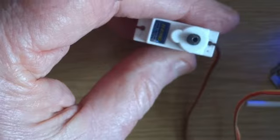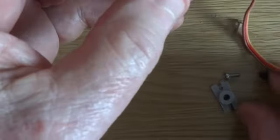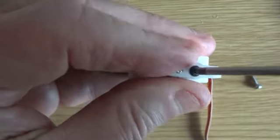Now we take our servo, and using trusty old servo tester, which you can get on our website, we move the servo to the center position, and with the servo tester, by just pushing that button, that takes it right into the middle. And then we take this horn and we place it exactly on there, straight across that way, and very carefully with this little black screw, which, as I've often said, have a mind of their own, screw that into there, and that's it. We can now remove the servo tester. We don't need that at the moment. We now have the servo motor out like that.